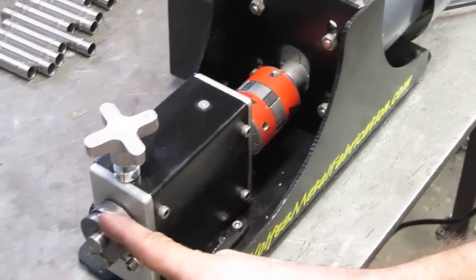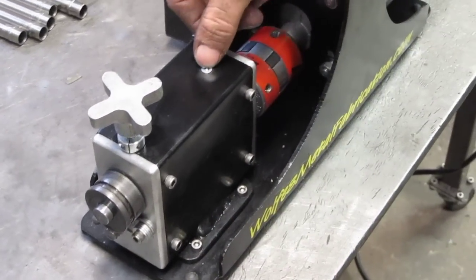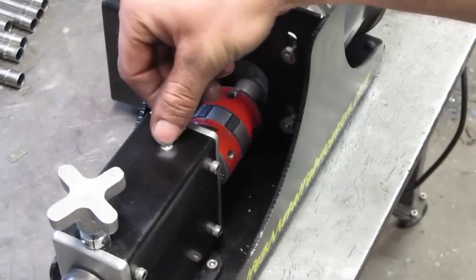For oiling, keep the dies well oiled. And then here's the little spring-loaded ball — you can stick an oiler can on there to squirt some oil in on the gears inside. Then also take out the adjuster and squirt some in there for the threads of the pressure adjuster and for the top bearing block for the top shaft. If it overruns in that hole in there, it'll go down the sides of that block and lubricate that.